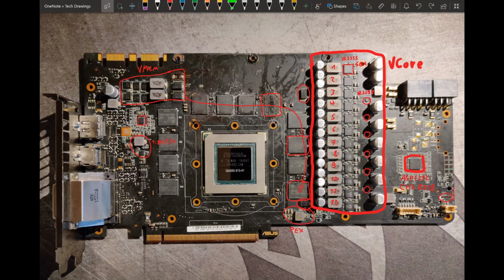It doesn't mean a big power stage is always good, but there's only so much current capability you can cram into a small package. When the package is so much smaller than these on this card, it can only have less current capability. Also, less surface area means it's going to run hotter. And I'm repeating myself here, but this is quite literally the same VRM, the closest you can get to an EVGA E-Power just built into a graphics card.